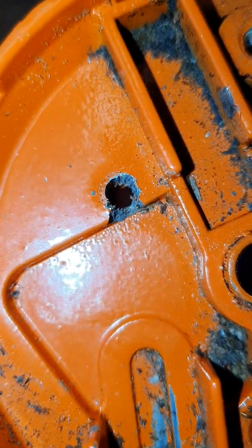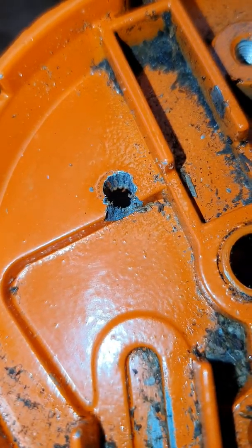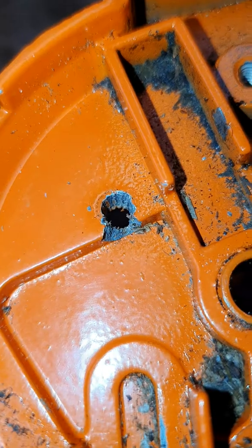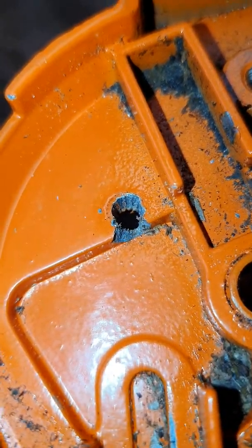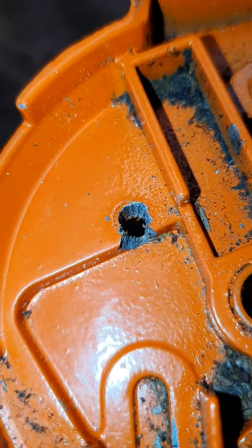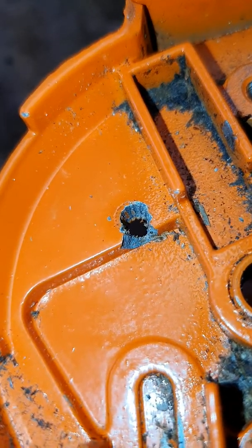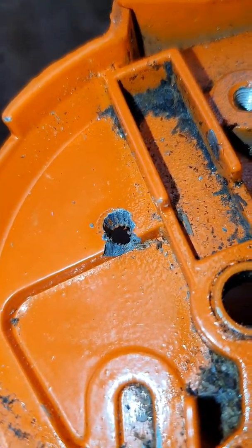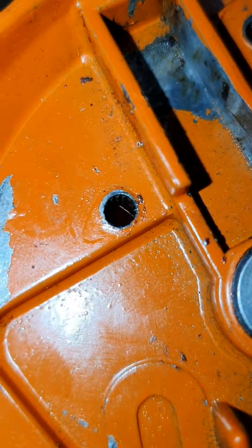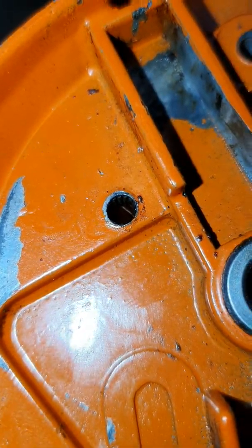Hopefully you can see that it's been broken away at some stage. I was wondering why the chain brake wasn't working properly, and when I pulled all this apart I found the pin was quite loose — it actually pulled straight out. That's probably the reason why the chain brake wasn't working. And here are the OEM cases; I had to punch this pin out.